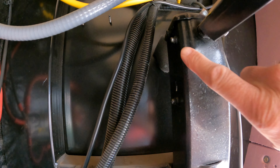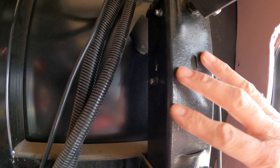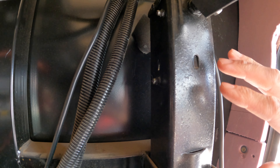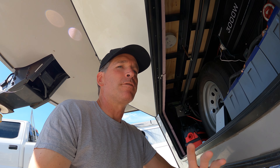It's really important to be prepared for that situation. Also, these do have some grease zerk fittings right here and here so that you can lubricate them periodically, and we do that as well. However, I don't really think it matters how many times you lubricate these — they will eventually fail no matter what, especially when you use the camper as much as we do. We're full-time RVing, so we're always raising and lowering these jacks.